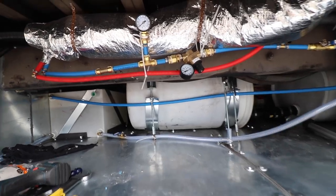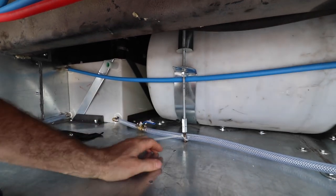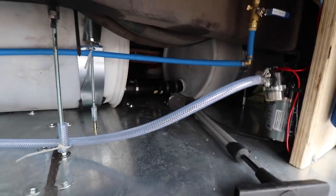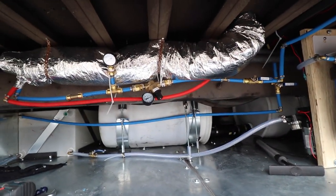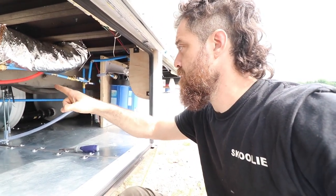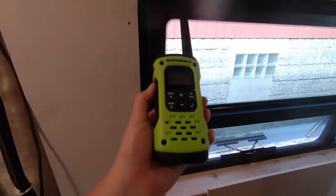All right, so right out of the gate, we're gonna turn the tank to pump on. So there's the water. Now we've gotta turn the pump on. Shower supply is open. Make sure the purge is shut. All right, let's charge the system. Aaron's going inside to turn the pump on because the pump's all wired up, and I'm gonna check the PSI and make sure that this PSI is not too high. We've gotta purge all the air out of the system. Water's probably gonna be spewing out from the mixing valve up there. So hopefully it all goes well. Yep, ready. Okay, here we go.